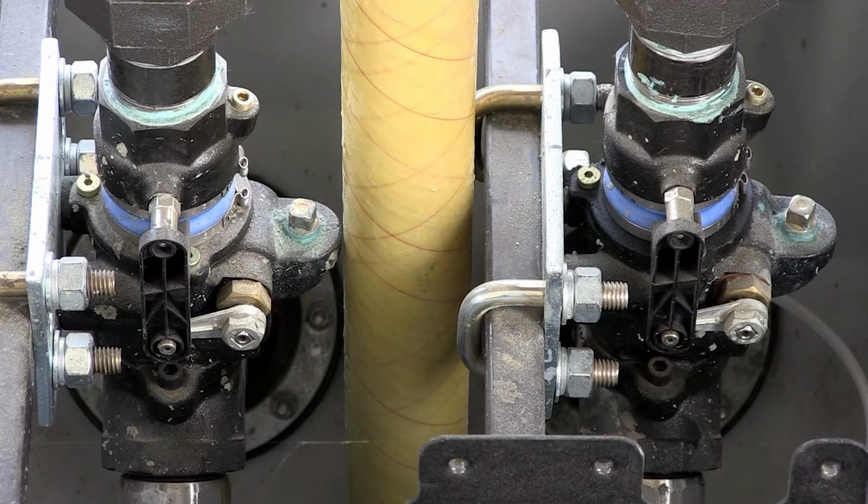If you're using flexible connectors, which we don't have at this site, you want to make sure that any flexible piping is installed according to the manufacturer's specifications. No flexible piping should ever have an S-shaped bend, no more than one bend with a constant radius inside of any containment sump. You also want to make sure that the shear valve is operating properly.